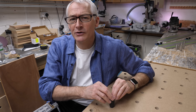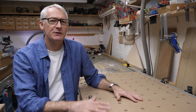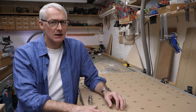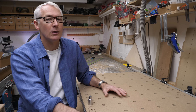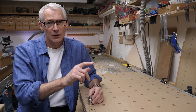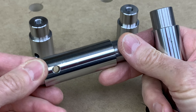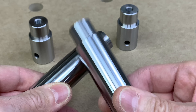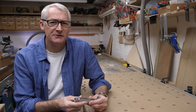Let me run you through what I received in the package from Silo Shop in a bit more detail. At the heart of the system is the Vario Bench top. The standard top is 1200 by 800mm; this is a slightly smaller one designed for the standard Festool MFT 3 frame. It manages a 600mm crosscut when using the Bench Hooks, as Silo Shop refers to them. The Bench Hooks — a pair of long and a pair of short — are very high quality and beautifully machined from a special type of stainless steel, and are a very precise fit in the bench top holes.